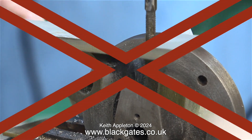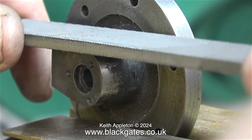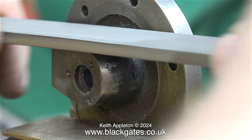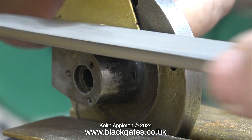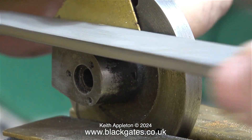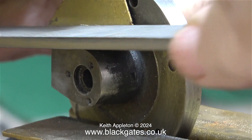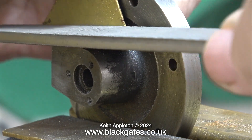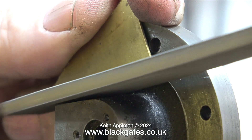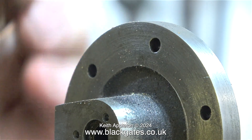After the threading job I fitted this part into the main workshop vise. Caution — do not do it like this, that's how the original marks on the bolting flange arrive. This particular file is quite new, very sharp, and has teeth on both sides. To stop it from marking the bolting flange I'm using a piece of brass — first of all a quite thick piece of brass, which is one of many pieces around my bandsaw which is next to the vise.